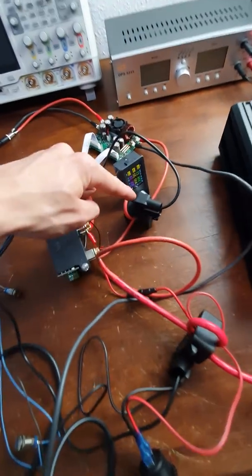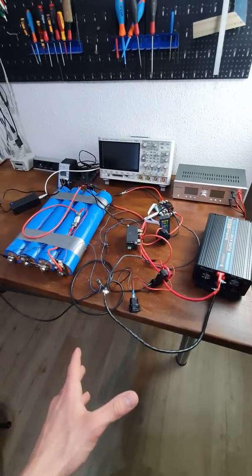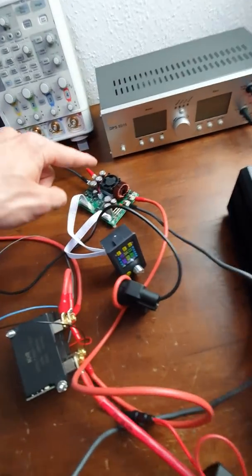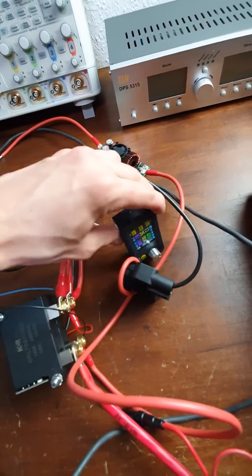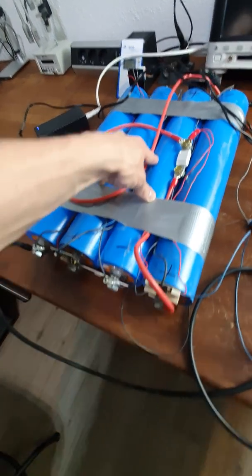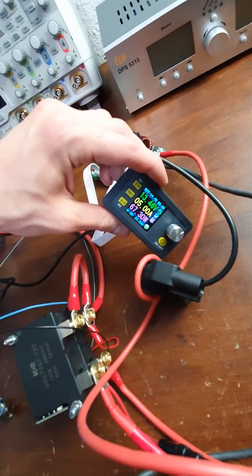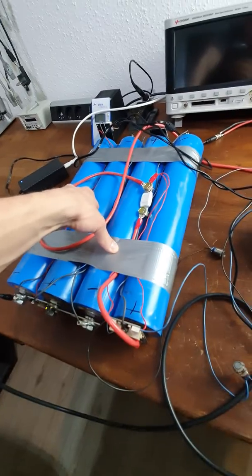To the BMS there are two current sensors attached - one for charging and one for the load. As you might have guessed, this is basically a DIY portable power station attempt. I'm using this battery pack which I'll charge with my lab bench power supply. Currently it's charging at a constant current of 5 amps. This is a 1.2 kilowatt hour battery pack, so right now it's pumping in 67 watts - that means something like 20 hours of charging.